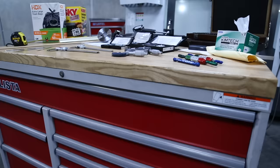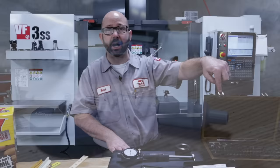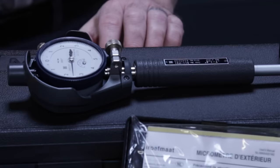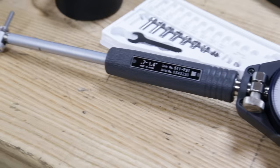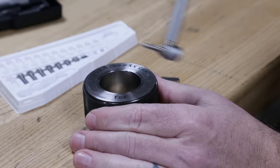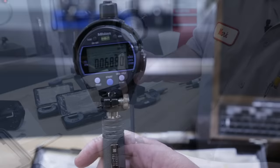So that was some pretty solid instruction on calipers and micrometers, our common tools. I'd like to quickly gloss over bore gauges, gauge pins, and blocks before we let you loose here, just so you know what people are talking about when you see them. Bore gauges are used to accurately measure hole inside diameters. Now they are similar to micrometers, in that they are only good for a certain range of bore. This set comes with adjustable anvils, rods, that can be swapped out or stacked so the gauge can be used with different diameter holes. Now we'll typically zero out our bore gauges using a precision ring gauge, and we'll check this often. And like all dial gauges, we need to look straight at the needle to avoid parallax. And digital indicators can also be attached.